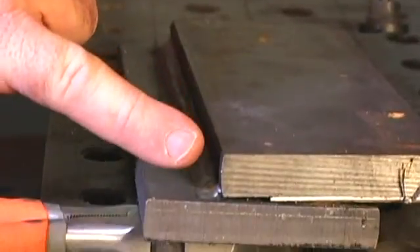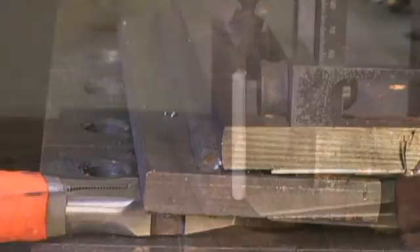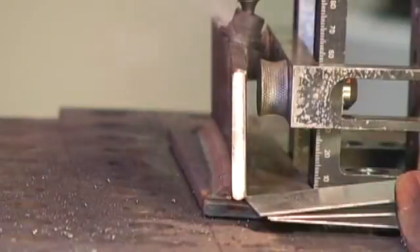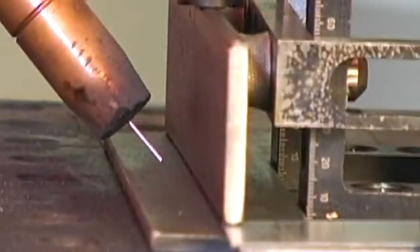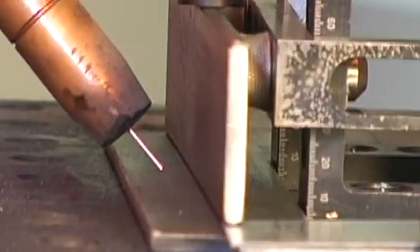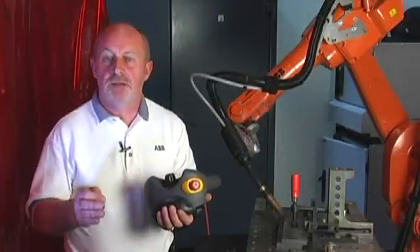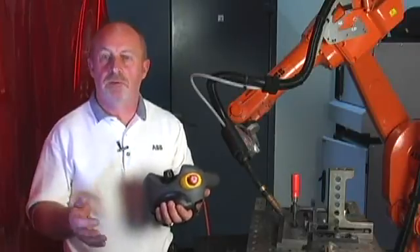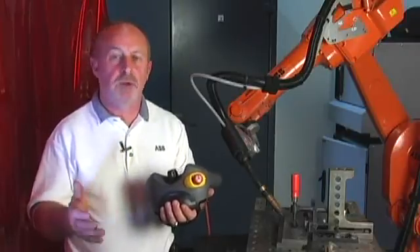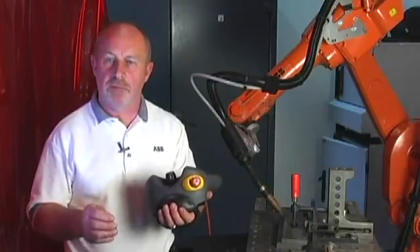The challenge in industry with most materials is there are gaps, whether it's by stack-up of tolerances or deviation through thermal influence of the welding. The robotic device needs to track very accurately where the two pieces meet. Today the capability of seam tracking enables general industry to track difficult joints that previously couldn't be done before, or that only heavy industry or automotives could afford. They're now far more cost-effective and far more capable.